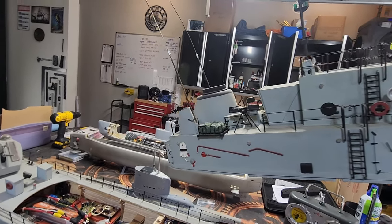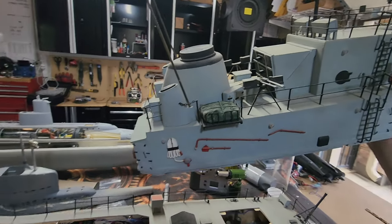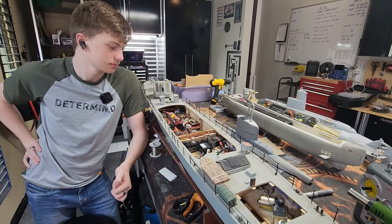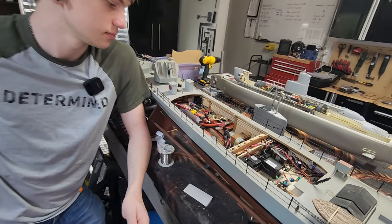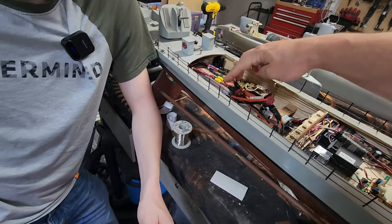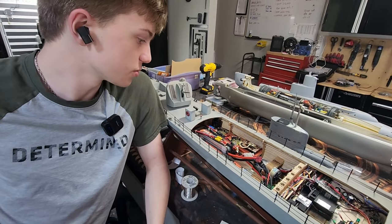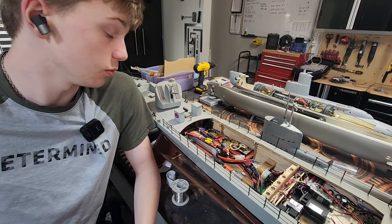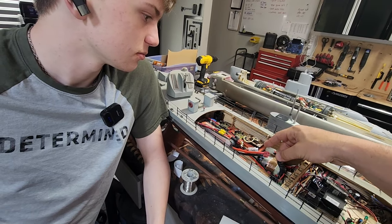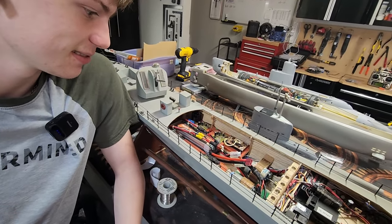We still haven't got that all figured out, but only because we just found these switches, I think. So we're going LiPo with this because they fit really well. So it'll be 11.1 volts instead of 12 volts, which isn't a big deal. We tested it and it's working. And because we had two leads, we're going to power each one of them individually. They're all Velcroed together, so you can choose if you want to have only one or two or all, whichever. And then this, I guess, is maybe for a third battery. If you want to be able to run this thing for 4 days straight, you can attach a third battery, but there's not a lot of room for battery in there.